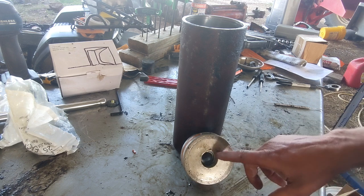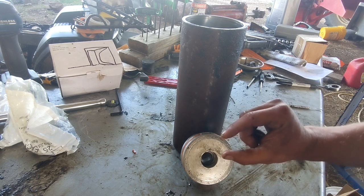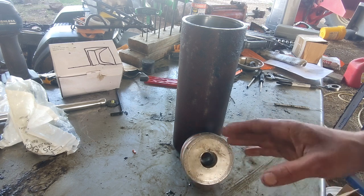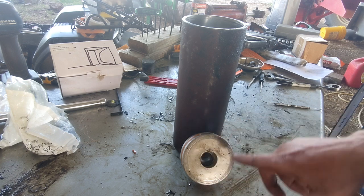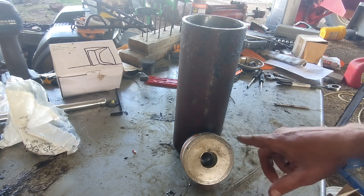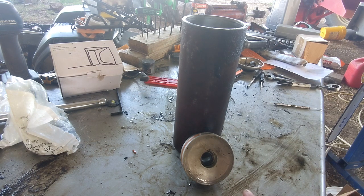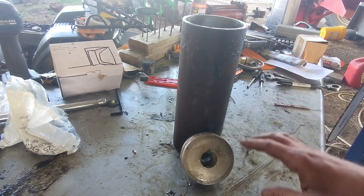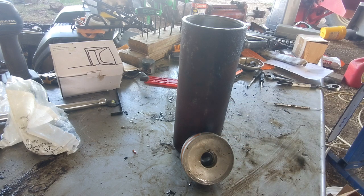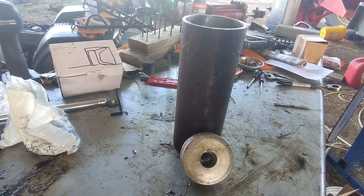The other side effect of changing the rod size is that since there's less volume inside of this part of the cylinder, this will try to extend faster, right? Because it's got the same supply of oil, the same pressure with the same flow rate from the pump on the tractor, but it has less volume to fill up because the rod's bigger, taking up more space in there. So this will try to move faster but with less force, and the other side will be moving slower but with more force. Or if this is still strong enough, this will overpower the other cylinder, right? It'll outrun it, and it'll actually draw a cavity of vacuum inside of the other cylinder, which is not ideal. So you don't want that. So that's kind of the main reason that you want the rod to be the same size.